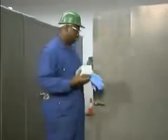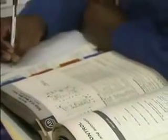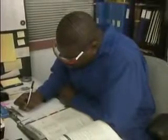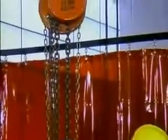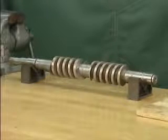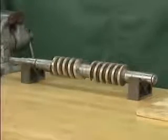For example, make sure that you have the appropriate protective gear. If you know ahead of time what replacement parts you're going to need, order them far enough in advance to have them available when the overhaul begins. Part numbers and other information can be found in the manufacturer's instruction manual. If the pump is large, you may also need rigging equipment, such as a chain hoist or a come-along. And you'll need a pair of V-blocks to support each of the pump's rotors while the rotor is being inspected after the pump is disassembled.